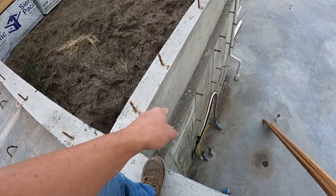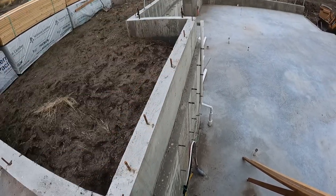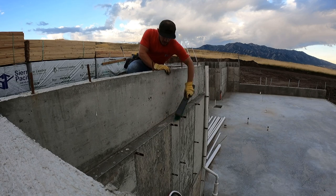Since our trusses are going to sit on this concrete groove right here, they have to have a bed made of treated lumber. Any lumber that touches concrete needs to be treated so that the wood will be protected from the moisture the concrete can hold. Our first task is to actually put a piece of treated lumber across this top half. One of the first things I want to do is clean this off really well so there's no big pebbles or anything like that.